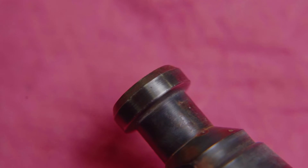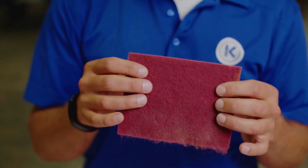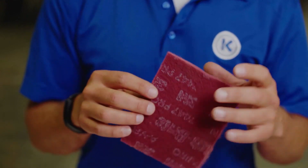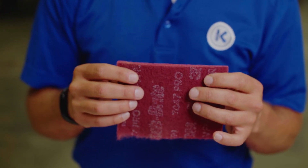The best way to clean and maintain your pull studs is using some type of light non-abrasive scotch-brite pad. These come in several different densities and you can get in there to scuff that particulate off the pull stud without actually removing any raw material from it.